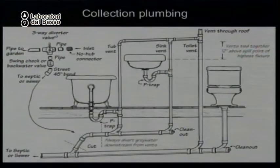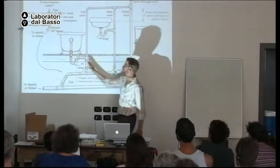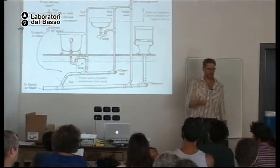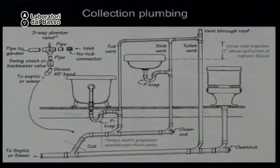You made me think of something. If I was going, I personally always want gray water from a bathtub or a shower if I can get it, because that's the highest volume of gray water of any source. But the bathroom sink is usually the lowest volume of gray water. And sometimes it is also the worst quality gray water, because toothpaste is full of salt. If it's baking soda toothpaste or whatnot, a lot of salt. So sometimes I don't bother with the bathroom sink.